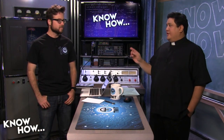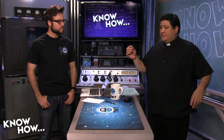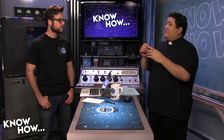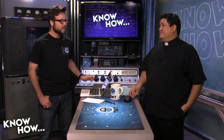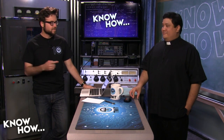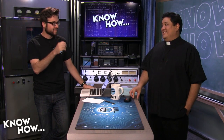You can also do that with just flux. In the chat room, they're talking about the flux strip, and it's the same thing. You just need to create a heat bridge because metal on metal doesn't always transfer heat efficiently. Right. If you put something there that conveys the heat really, really well, like flux or like solder, it just goes. Yeah, I found that very helpful for my own soldering stuff, but also props on shooting that because you really get into the fine detail and you can see what's happening.